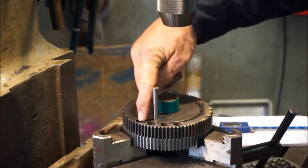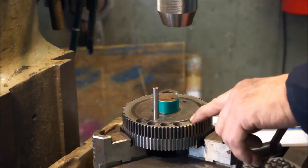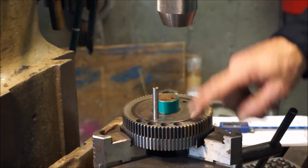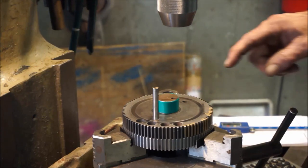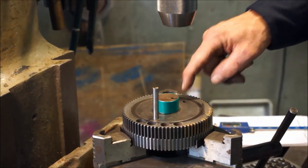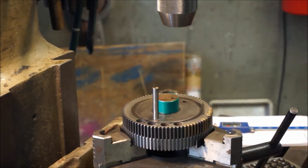I don't know about this ring right here being in there for any reason, or if it was an accident from whoever tried to braze up a couple teeth on here before, might have accidentally come in and touched that area. And I think that is coming around the attachment on this to engage the back gear or lock the spindle. I know this is a purposely made little clearance in between those two holes right here, and I want to add that to mine, but I'm not going to do it with a wheel cutter. I'm just going to come in and do a little spot with an end mill.